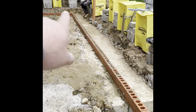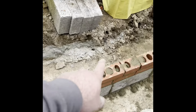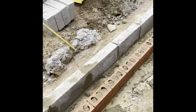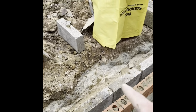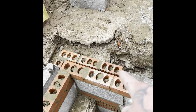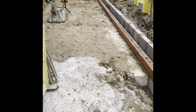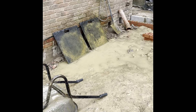After lunch I'm going to bring one course of block all the way around on the outside and start down in here in these lower footings on the external. We've got a course of block around on the outside as well. It steps down here but so does the ground level, so it's going to have to be face brickwork on top of there and around that corner, step down again with just one course of engineering brick, then external blockwork down. The internal brickwork is at underside of beam now.